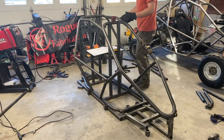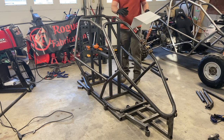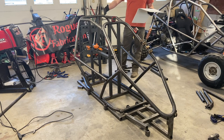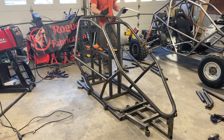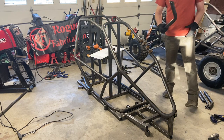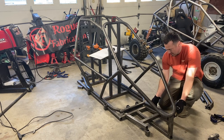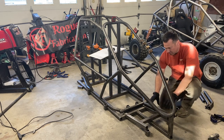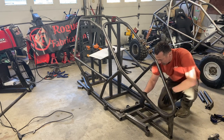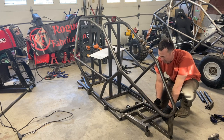I just put in the roof rails — they're squared and look good. They just have a light tack on them because the rear uprights are going to be the deciding factor of where this line is. Next piece are the lower A-arm attachment bars. These pieces on the bottom were used on the jig to help align this, and they need to be perfectly square with each other and perfectly spaced apart.